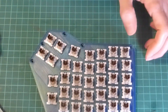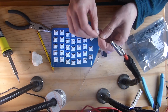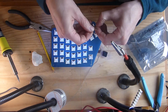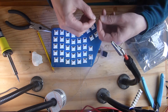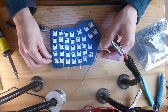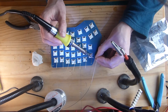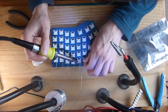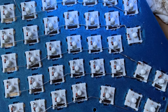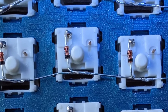Then wiring up. I followed the instructions from the QMK hand wiring guide. I'm not sure I've done my rows and columns the best way, but it's certainly functional. Loop the diodes and check the polarity first, then bend the legs and solder the rows. I used a bit of spring in the metal to hold each one close to the next. The aim is to have one on a switch pin, then 90 degrees to its neighbour after the diode. Then trim some wire and solder the columns.